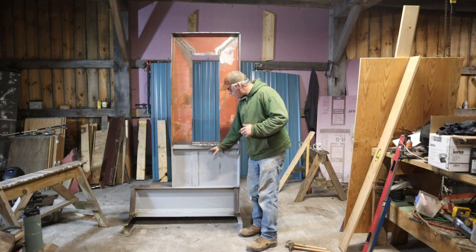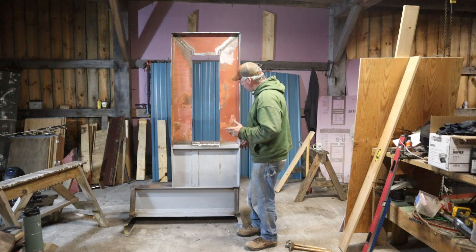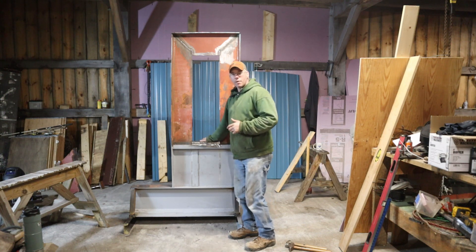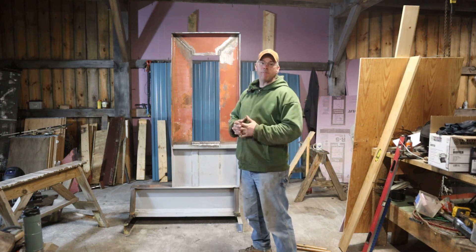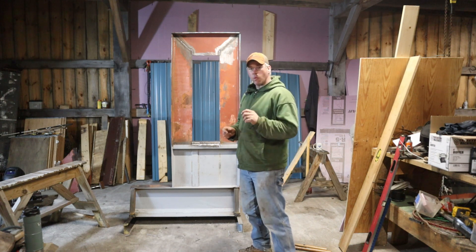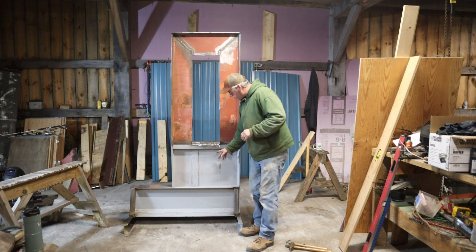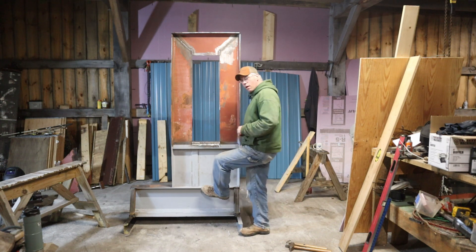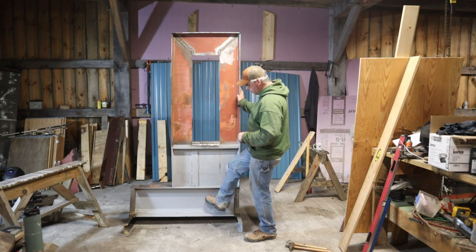People mentioned stiffening from here all the way down underneath this anvil plate. I actually have that on the back side — it goes all the way down to the bottom. That was just the bottom of one of these I-beams cut off, and it had a big piece of ½-inch plate steel already welded onto it, so we were able to make that pretty stiff. I'll probably get some more 2-inch square tubing and run it from down here to this webbing, and probably continue it down to the bottom.